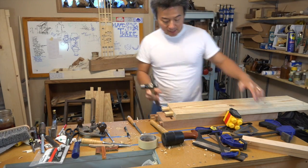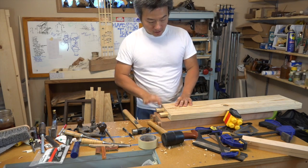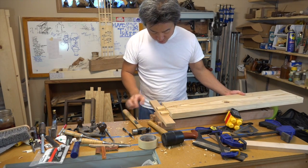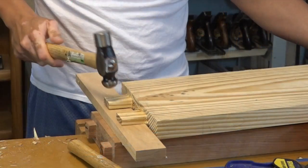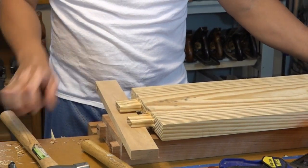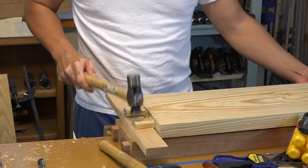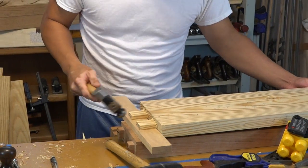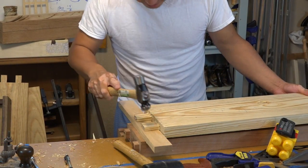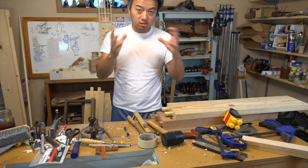Another way to fit the tenon is by bruising it. This works with wood that is relatively soft — in this case, the pine here is fairly soft, so I'm pretty sure I can bruise this. I'm just taking the backside of the hammer here — this is going to compress the fiber more, making slipping in and out fairly easy even once you get a fairly tight fit. But if you need to disassemble or reassemble something, that disassembling and reassembling is going to cause the fit to become looser. The bruising — if we just leave it there and the glue is stuck into it, it will expand and create a very tight joint.